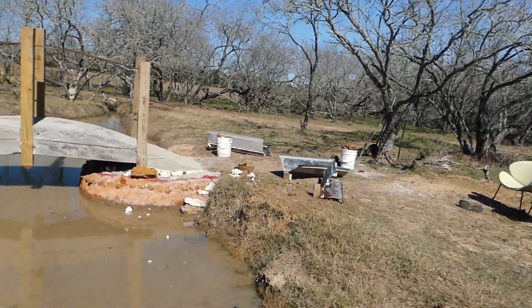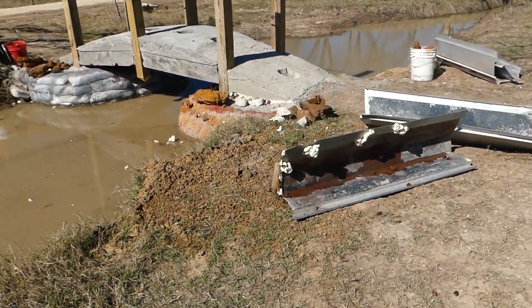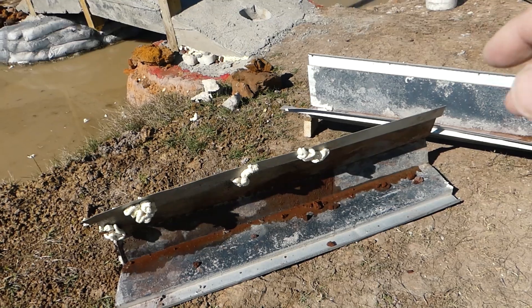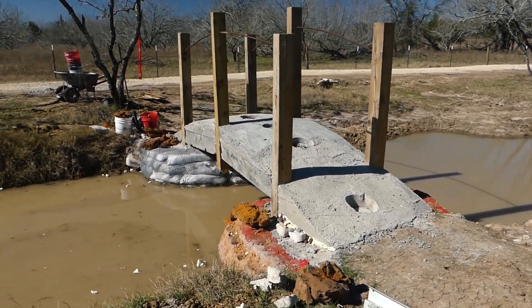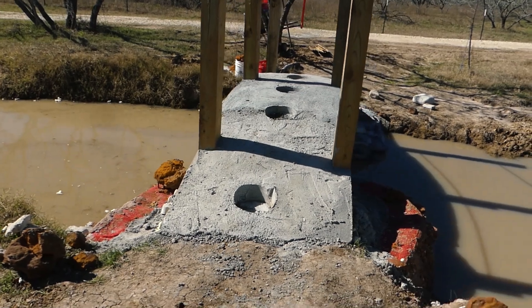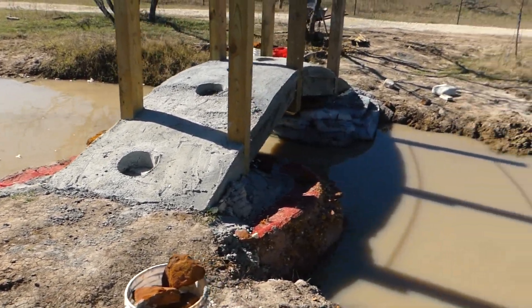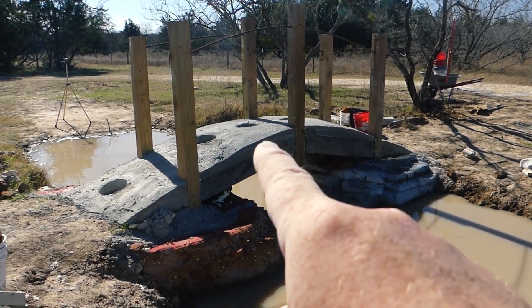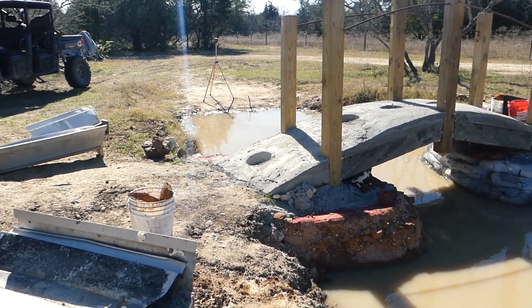Take a look at the molds — I didn't use any mold release at all, I just used cedar pickets. They came right off and didn't stick. Over here this is flashing I pulled out of a dump — it was crushed in a tornado, all mangled up. It was good for me to beat it out, make it straight again, and use it for those forms. That looks pretty good, really does. I'm thrilled. I just need Portland cement for those test spots. My perlite came in, so I've got enough to do testing — I'll do a one to one, two to one, and three to one ratio. I think three to one will be too soft. I'm interested to see how rugged perlite is or if I'll have to overcoat it with something.